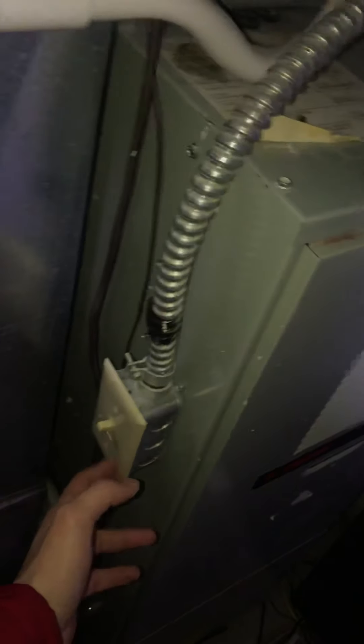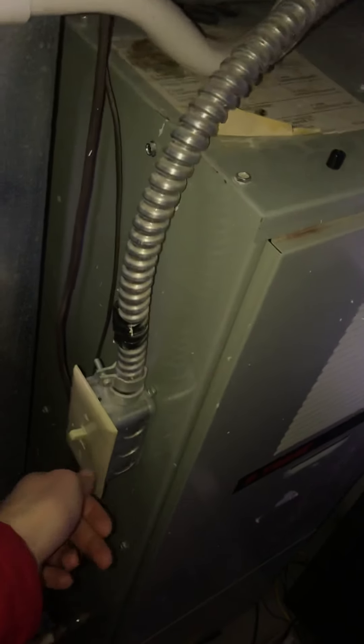The second special note: we want to move this power switch because the kids keep turning it on and off — this was an old furnace so we'd think the furnace was out. Move it up here on the coil, or on the wall if you can find a stud — just somewhere that's a little bit out of reach for the kids.